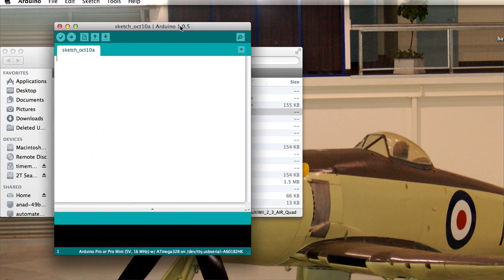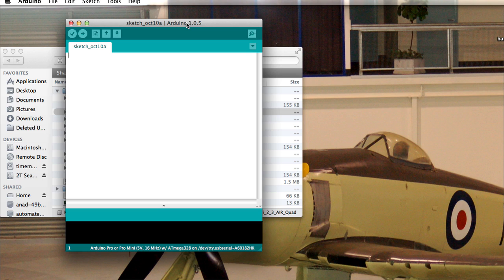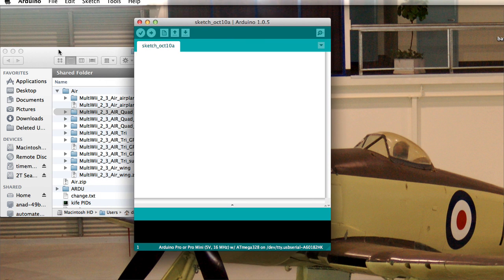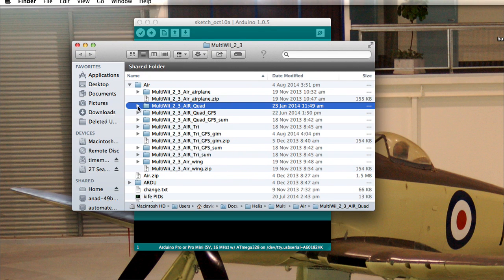I'm going to open the Arduino software. Now, version 1.0.5 seems to be the most stable. There are later versions, but it seems to increase the file size sometimes, and you don't want that on an air because we're a bit limited. So I've got the Arduino software open, or if you don't, I'll put a link below on where to download it. Now, I've downloaded some files off the MultiWii website or off the OzScarab Facebook users group, or you've been given a sketch file by a trusted person. Be careful, there's some dodgy files out there.